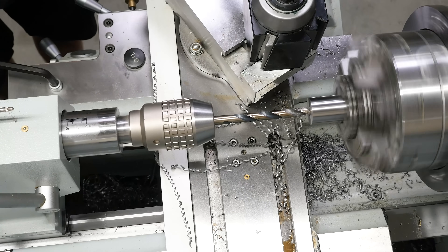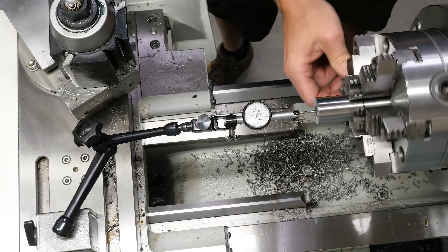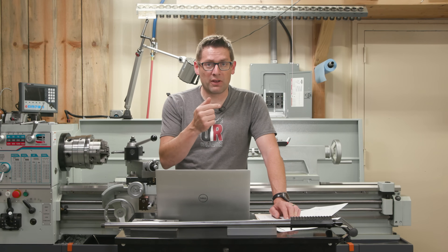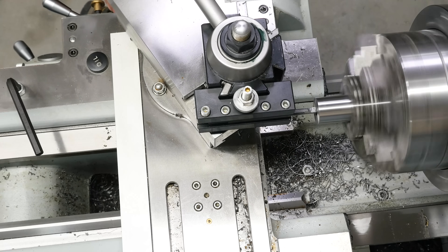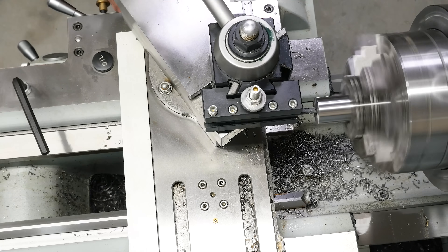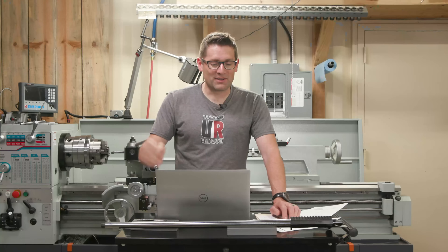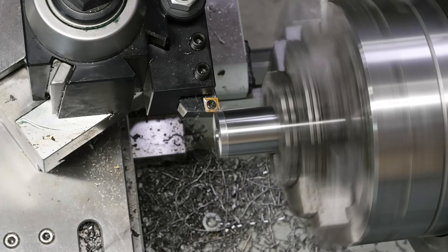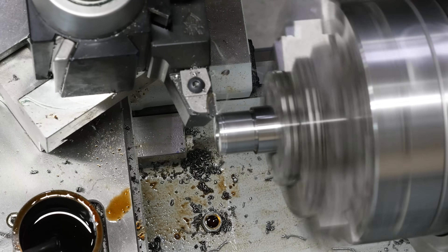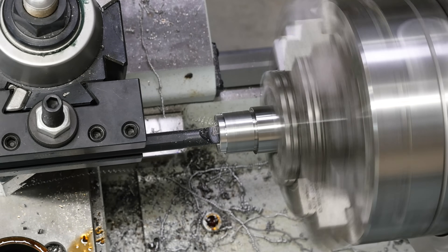Then I can get the nose of my indicator into the critical throat area section and about an inch ahead to do my final dial. Once the final dial is done we bore out that pre-drill area perfectly true, so when the reamer comes in later it's riding on a surface that's perfectly concentric with the lathe spindle — the reamer starts perfect, we avoid chatter, and things finish perfect. We turn the tenon down to diameter, cut the thread relief, cut the step down, and then cut the counterbore.